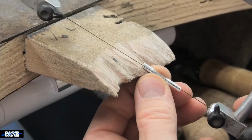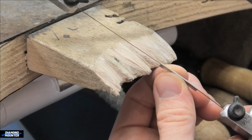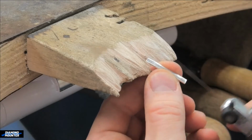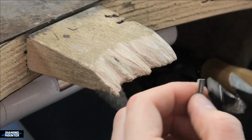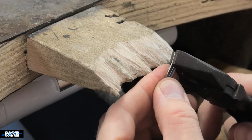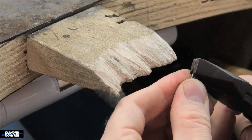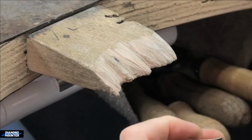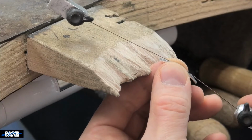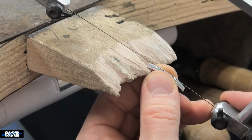Right, cutting that line all the way down the middle. Check this out. When you push on that, you need to cut a straight line, but when you push, your saw blade bends a little bit, even when it's really tight. That's no good. That means your saw is only really cutting the end, not down the middle. So to cheat a little bit, this is just a flat strip of metal, so I don't think there's any harm in putting a very gentle curve on it, all the way down the middle. Now, I curved that quite a lot, but now I can push on that and my saw blade can go right across it at any point. No difficulty at all. Actually, the middle has now become the easiest part to saw.